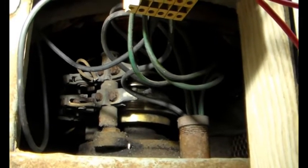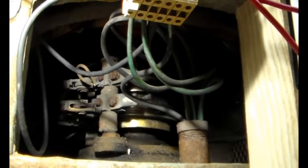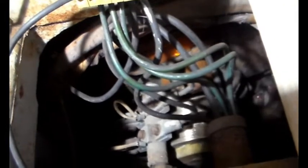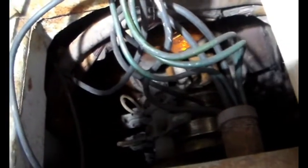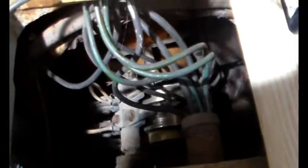That then sets the magnetism — the residual magnetism of the rotor, which we've not seen and can't really see. But it is effectively four big coils, so four big magnets on the rotor, supplied by two slip rings. Basically, there's a positive and negative slip ring and four magnets, and they're huge.